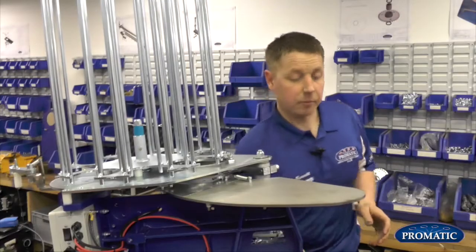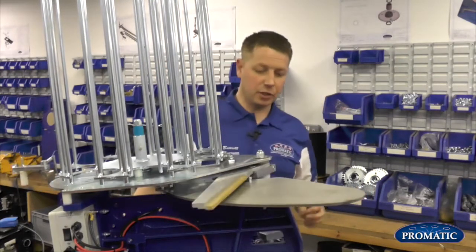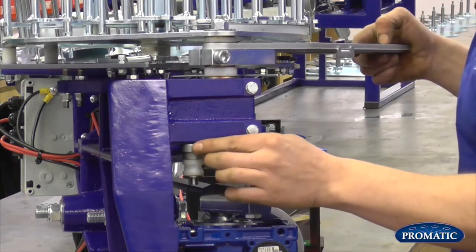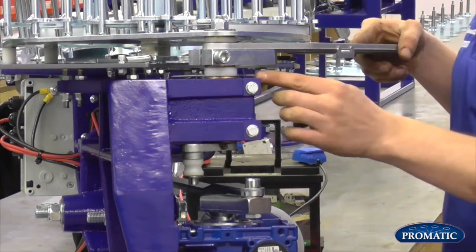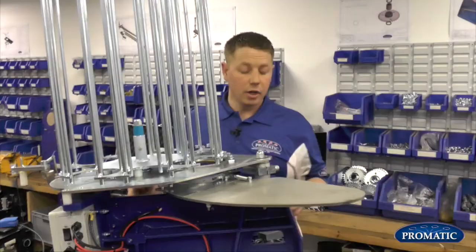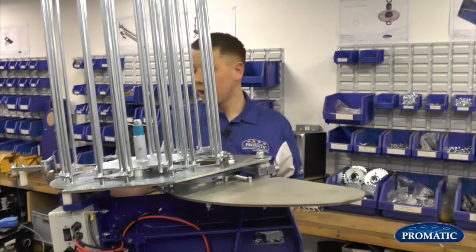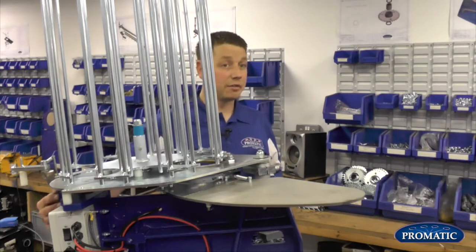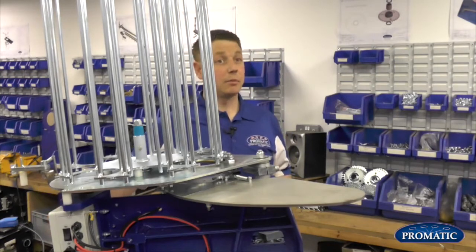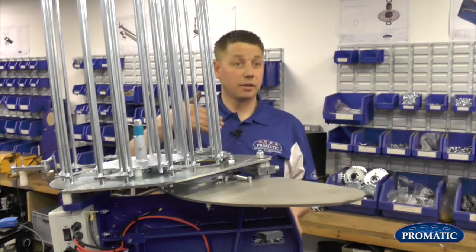And as you're doing that, how would you know what is the right position? The right position is, as you bring him round there now, we know the main shaft is just poking slightly through, and then your reference is your clamp block is in line with the actual split. When you put your spring back on, to know that you've actually got it right, we're looking for the machine to fire when it goes over the centre of the frame. So as we look at the back of the machine with the spring on, when the machine fires, it goes over centre, the trap fires.